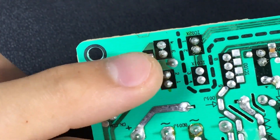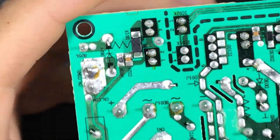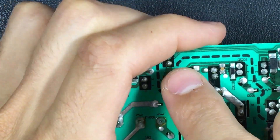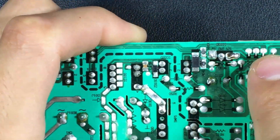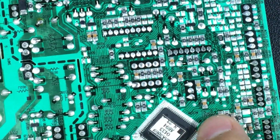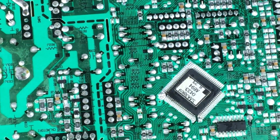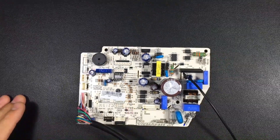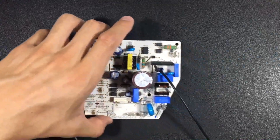On this side we also have a resistance, capacitor, and another diode. Notice that on the other side of the optocouplers we already have the tracks that will take us directly to the most complex part of the circuit, which eventually leads us to the microprocessor. The microprocessor communicates with another microprocessor — indoor and outdoor unit — through those optocouplers.